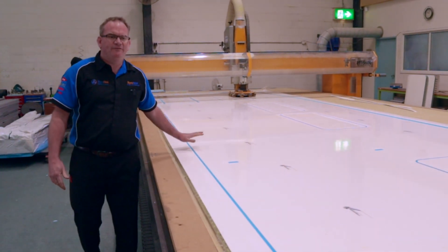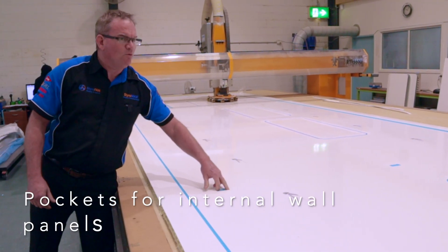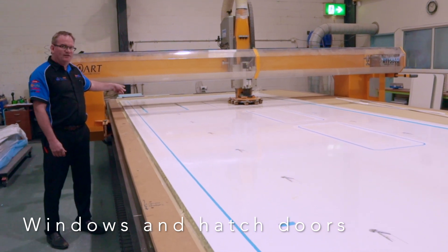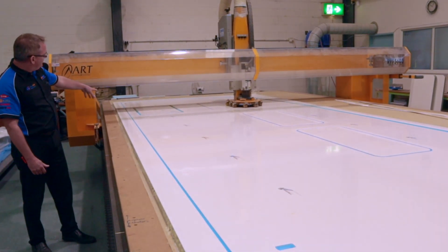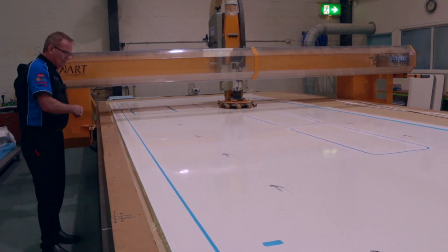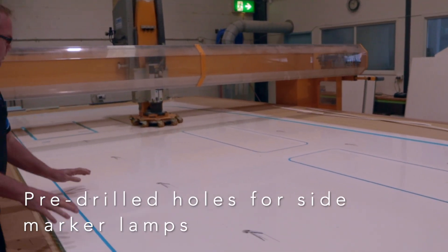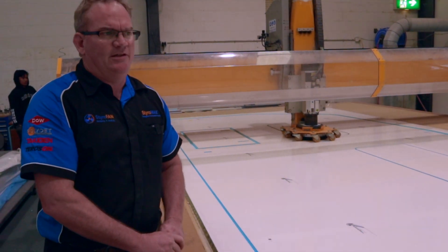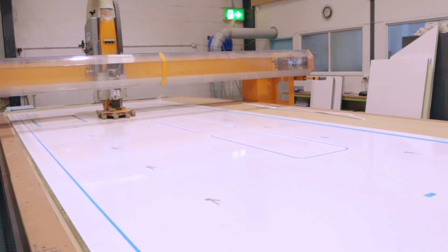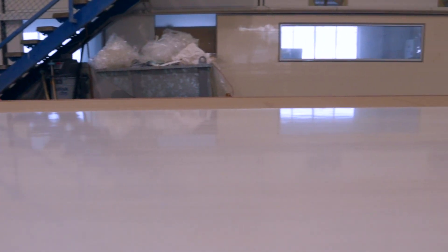This is the inside face of the driver's side wall — it's just about on its bottom cut now. We've got pockets machined into the wall for the internal walls to lock into, window cutouts getting done, and a hatch door up the front that's pre-cut with the styro seal LT styro lock medium, so that hatch door will be ready to trim up with our aluminium extrusion system. You can also see we're drilling holes for the side marker lamps, all pre-done, which will provide extreme accuracy when we put this thing together starting next week.